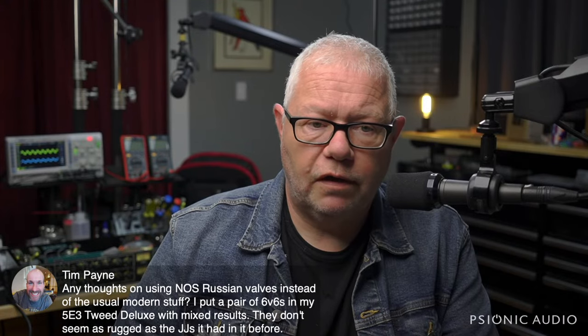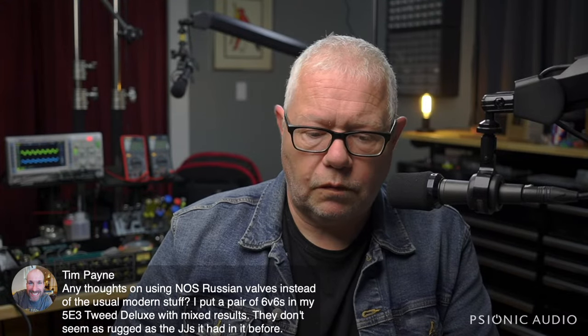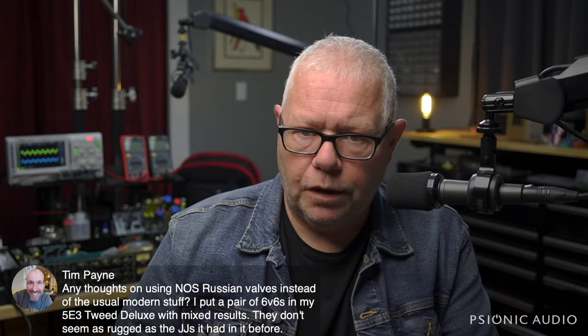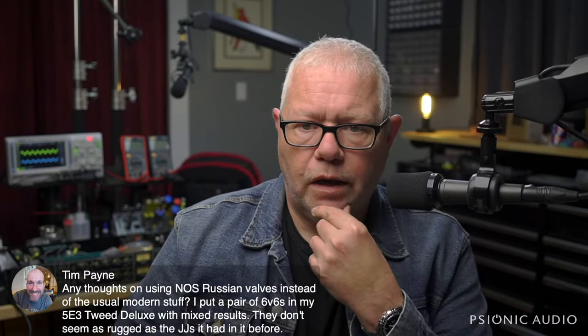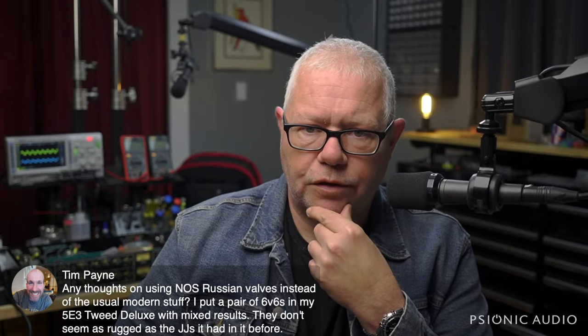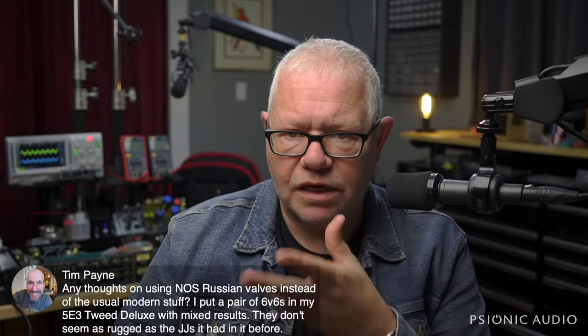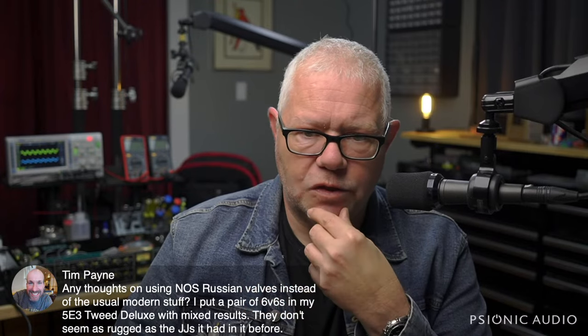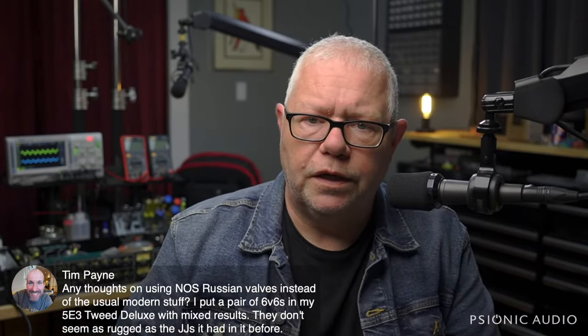New old stock Russian valves are all over the map, Tim. It's like a lot of things, buy the vendor, not the product. So find a tube vendor that you can have a relationship with and ask them what they have in stock that's good. And if they have some Russian tubes that they've gone through and tested and they stand behind, that's one thing. But if you buy them off eBay, et cetera, you don't know what you're getting.